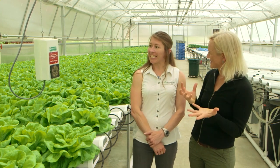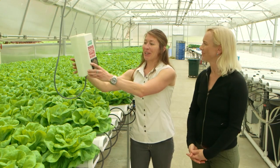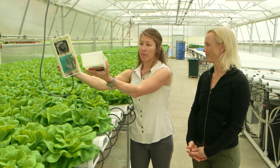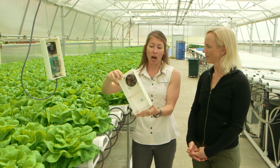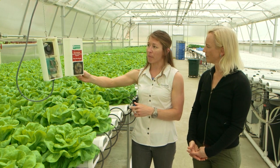This one looks a little dirty — it's got some dust on it. How often do you want to clean it and how do you clean it? Clean the filter monthly — that's what we're going for. The filter is real easy to clean. I just pop the shoe box style aspirator apart, take the entire lid, rinse it under some cool water, dry it off, and just make sure that I put the lid back on with the filter on the bottom and the fan on the top.